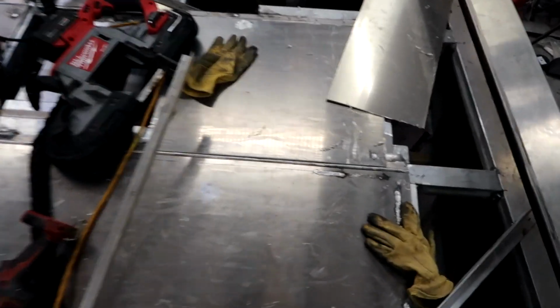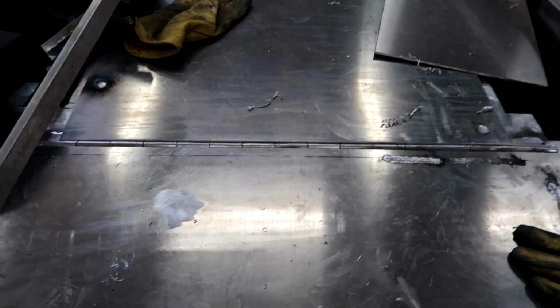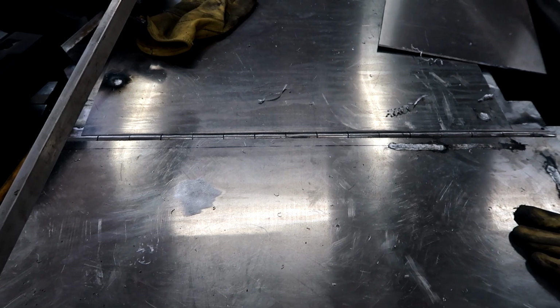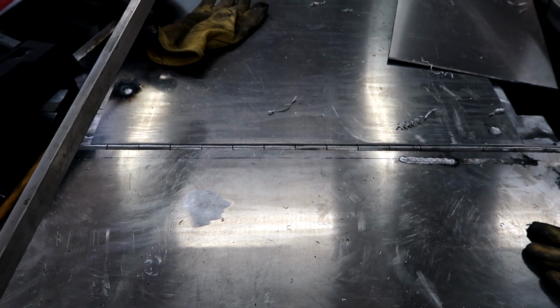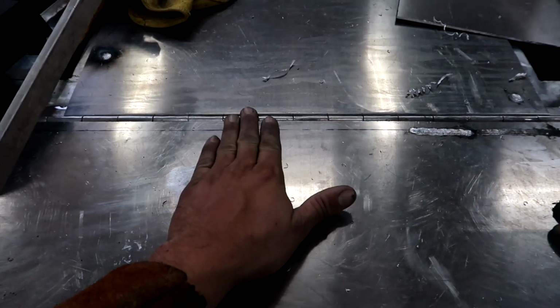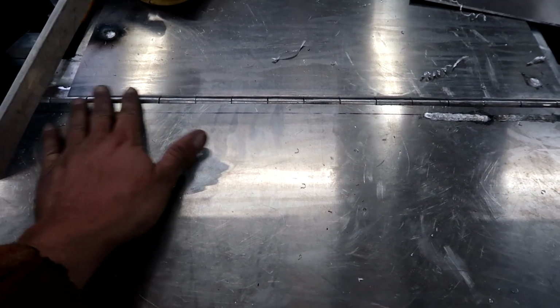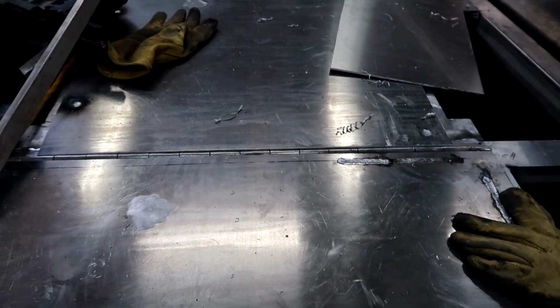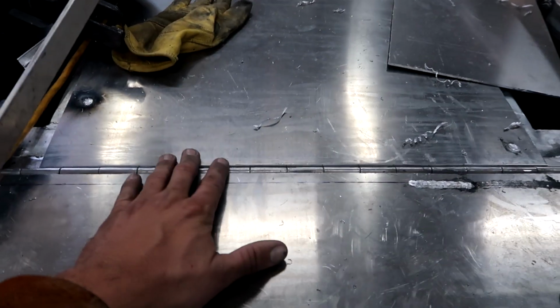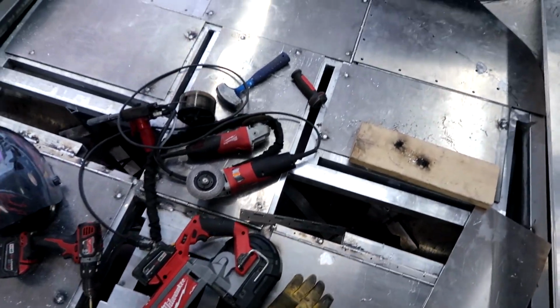As I said before, guys, these are big hinges that I'm using. These are kind of lifetime hinges. I'd say they're 3 to 4 times the size of the normal hinge that you see on a boat. By using the 3/16 metal here on top of this big hinge, you can see the way I butted all these up. It's just a complete smooth surface. So this is the big live well here. This is the second hatch. It opens up, and I've got all the other ones done.